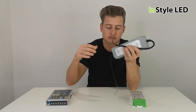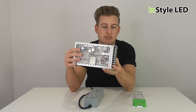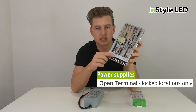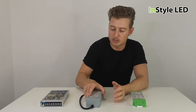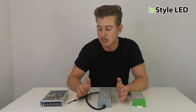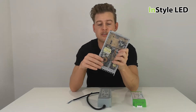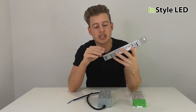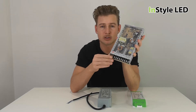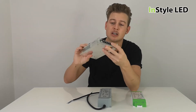Here we have what we call an open terminal power supply. As you can see, the open terminals can be touched. I'm not an electrician myself, but any installation with transformers and 240 volt must have an electrician. Power supplies with open terminals need to be installed into a secure locked cupboard.